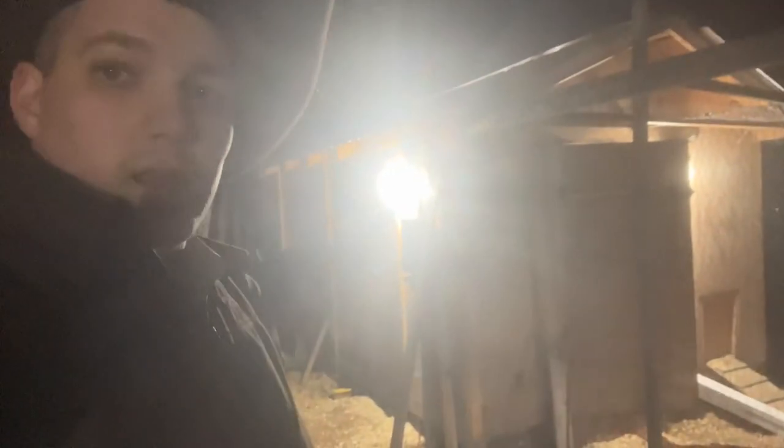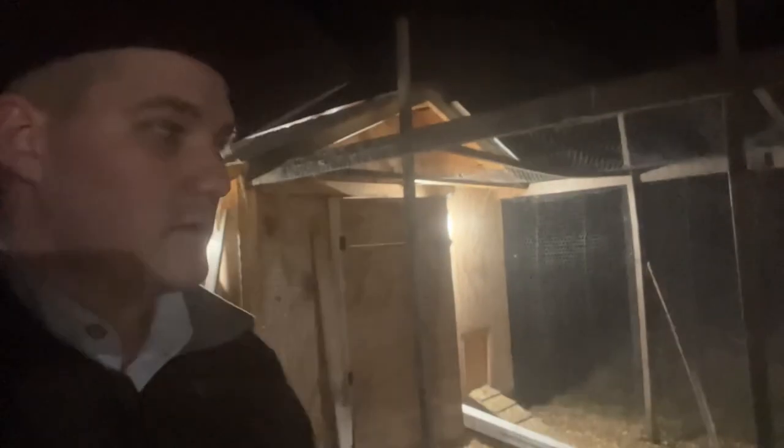This one's going to be built a little bit different than the last one. But you'll see that as I go. So instead of doing vertical studs to hold the plywood in, I'm actually going to build this a little bit like a pole barn, where they put stringers across and you can nail straight to the stringers. I put a 1x4 down for the difference in batting or covering that crack in the wood.